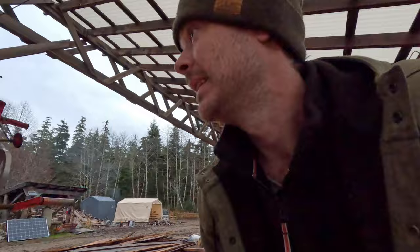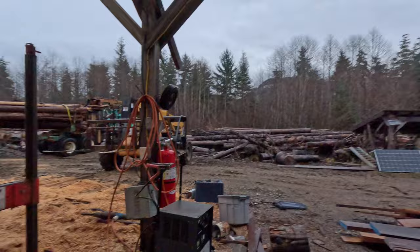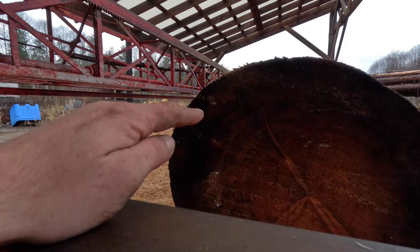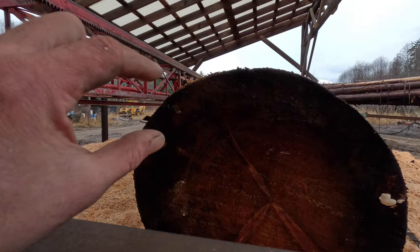We're gonna go double check that in a minute, but I wanted to show you here. So the bottom edger blade right here is what we're setting with that height. So I'm way up here near the top of the log, okay? And that's because I'm gonna take a layer of 1x2s across the top so I get some stickers.